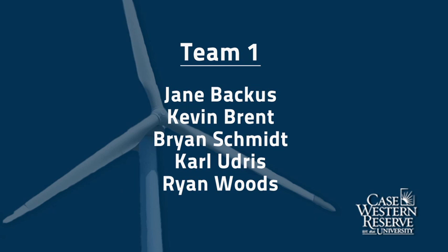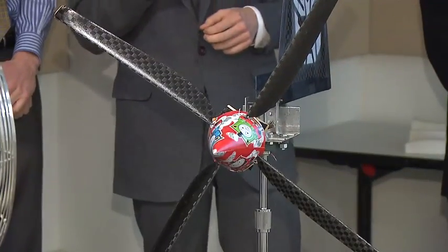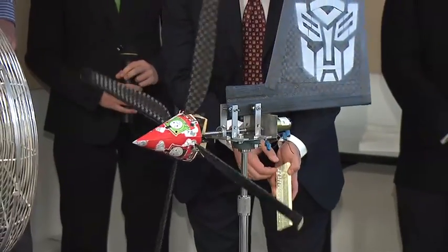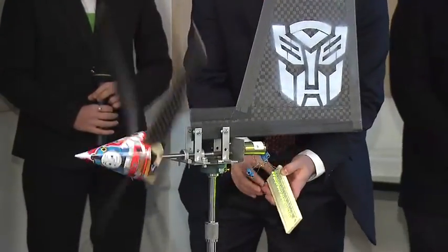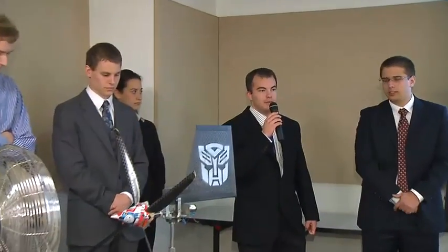We discovered that as the blades turn, it perturbs the flow, and so the vane perceives flow coming in at an angle — that's why the vane is offset slightly to make sure the blades stay orthogonal to the flow direction. We would like to demonstrate our wind turbine. One of the issues with wind turbines is cost-effectiveness without government subsidies. You've chosen carbon fiber, which is a relatively expensive material. Could you comment on that? It was readily available on campus — they had a big bin with plenty of carbon fiber scraps — so in our perspective, it was cost-effective.